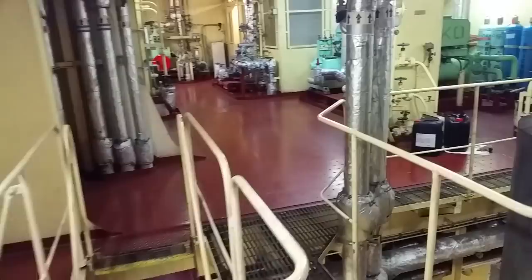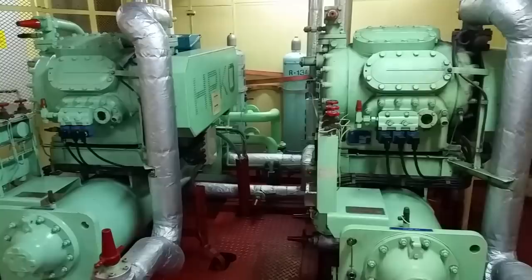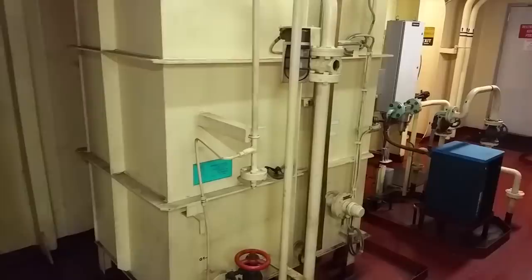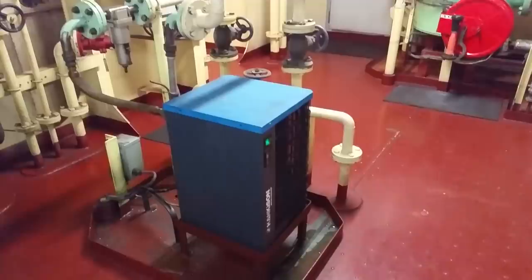We're almost done the tour. This is the main AC plant — there are two of them, and that's for the house air conditioning where we live. Behind me is a cylinder lube oil tank — I pump that up every day on my rounds. There's a controller for the AC plant. This is a little air dryer unit — the name says what it does: removes moisture from the air. This is a calorifier, a water heater unit, with the heater element visible.